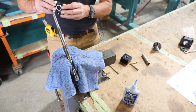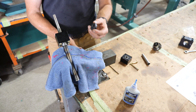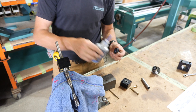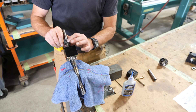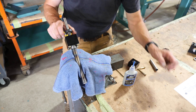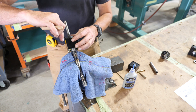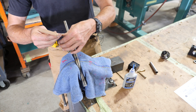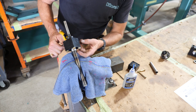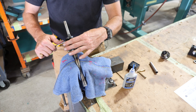We're going to put this ball assembly housing together — slide this on and seat it all the way down to the bottom. We're going to get our set collar, put some Loctite on it, screw this on, and tighten this down to take all the end play out of it. We're going to wrench it down, make sure it's seated all the way against this back ledge here.